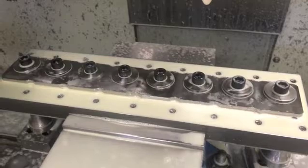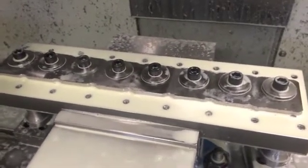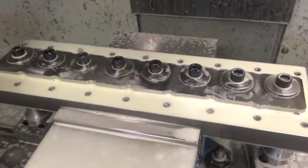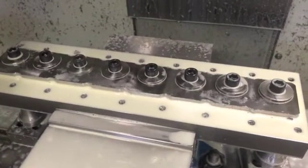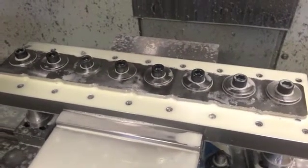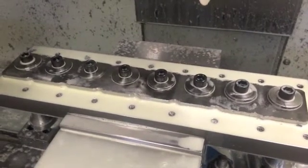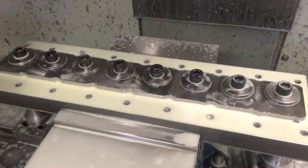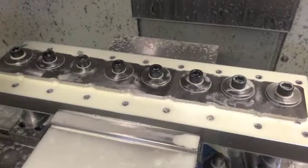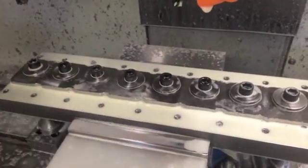This is the second op of the recoil lug. The first op basically turns all the extra stock outside of what gets contoured into chips, so that it doesn't interfere with the final product and put denser material on the outside of the recoil lug — that's those little radius contours you see.